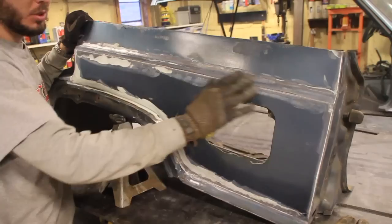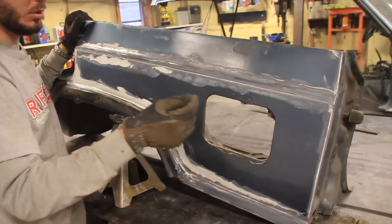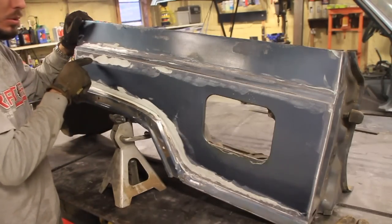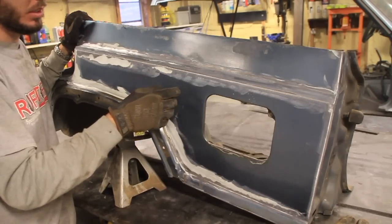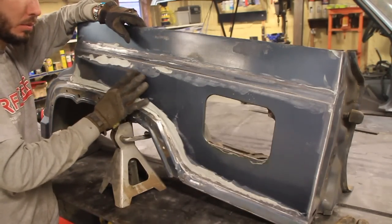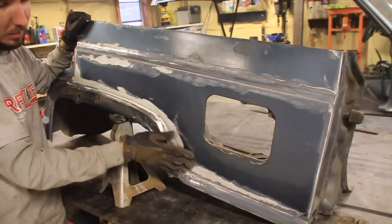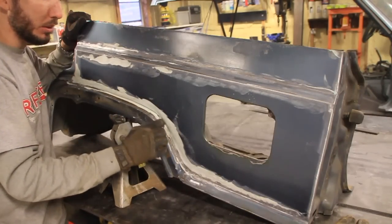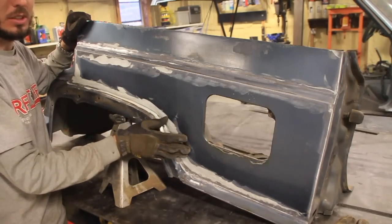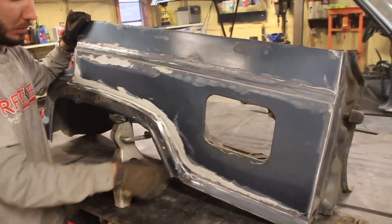Now, I'm going to actually weld this to the body, but you could also use nuts and bolts. You want to probably countersink them, so you're going to make some holes in your steel over there, lay this flat on here, drill those holes, and then bolt it all down. And that would be the way to go for the most part, but in my case, I'm just welding it on here. Somebody has added a whole lot of Bondo right here, so that's going to make things a little more difficult for me welding in here, because there is probably a 1/2 inch of Bondo on this surface. I couldn't even tell until I got into it, because it was a pretty good Bondo job, but we'll see if we can work with it.